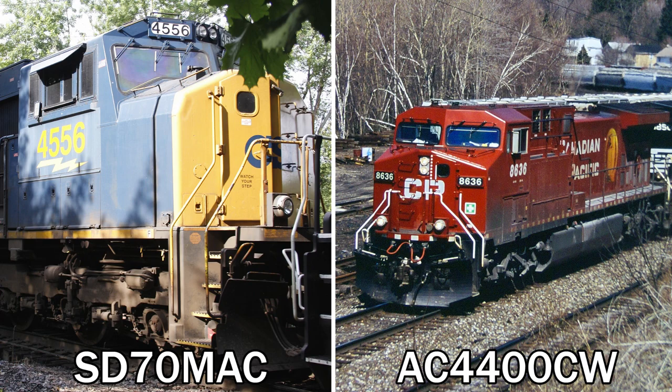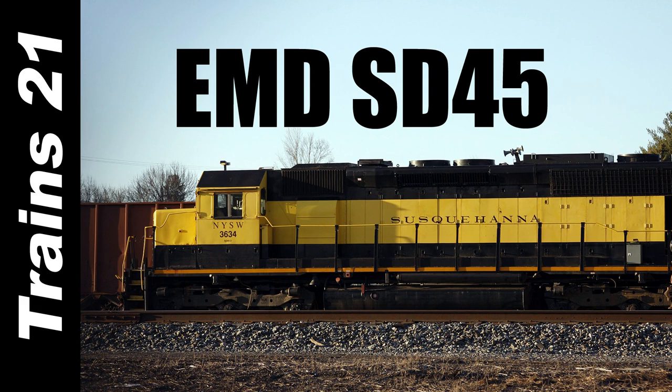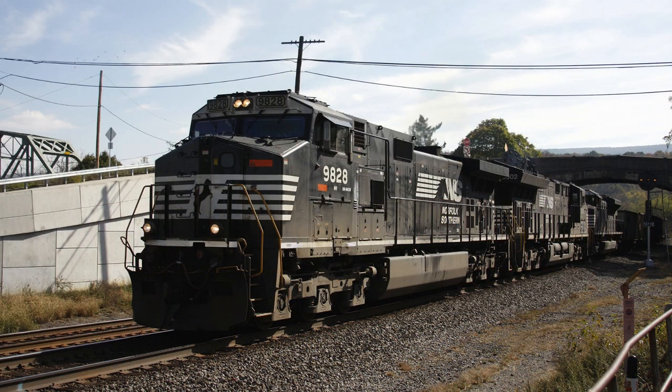EMD introduced their low-weight transfer truck, the HTC, with the Dash 2 line. We talked about it briefly in video T176. There's a link to that video in the description box and in the pinned comment, just in case you missed it. GE came along later with special trucks under the Dash 9s.